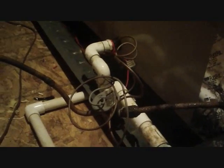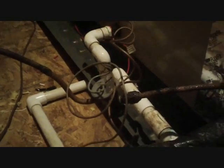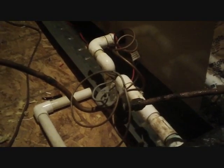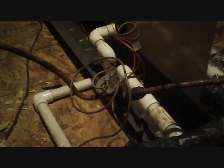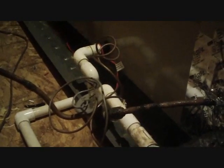You can see they added a TXV whenever the system was changed out about ten years ago, because the air handler is from 1992 and had a piston — they were trying to make it more of a rated match with the TXV. It does help a little bit but there can be certain problems with the heating cycle. It's kind of an unorthodox way to mount it, but you can mount it inside a cabinet if there's enough room.